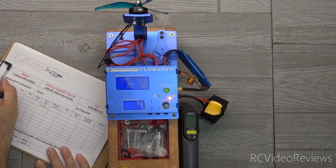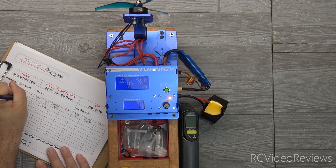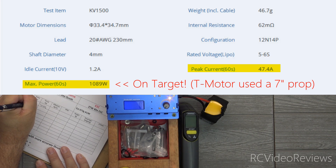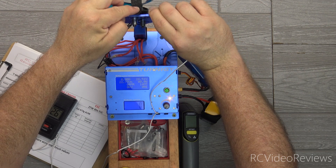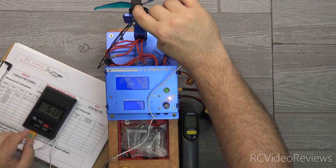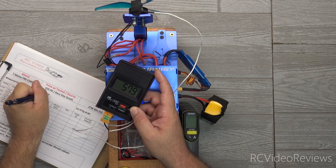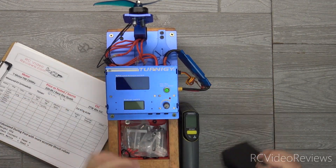For amps I saw 43. For the volt sag it looks like 24.29. Really strong, and the watts: 1000. Wow. Let me stick a thermistor on there real quick. I know it's had time to cool, but actually it gets a little bit warmer as it sits. All right, that's it for the first test. I'm going to switch batteries now, get this one on the charger and get it peaked up.